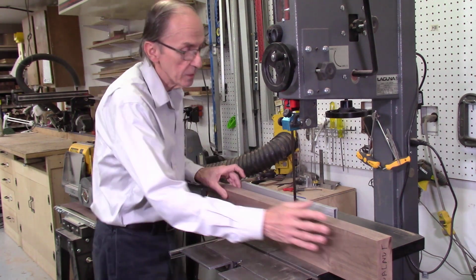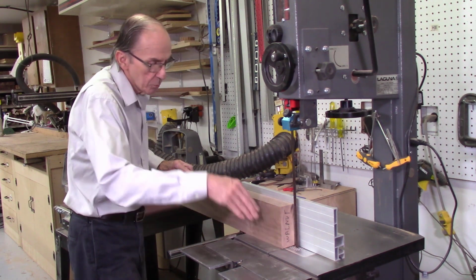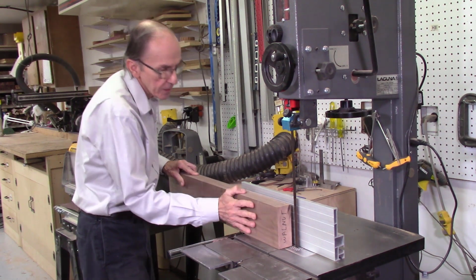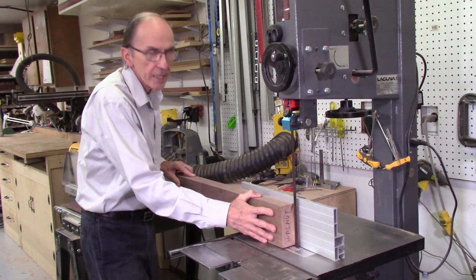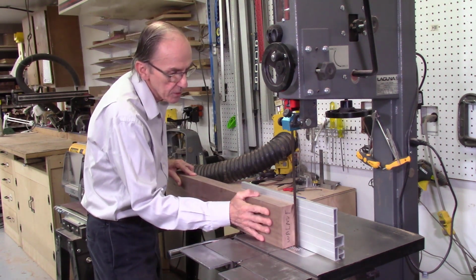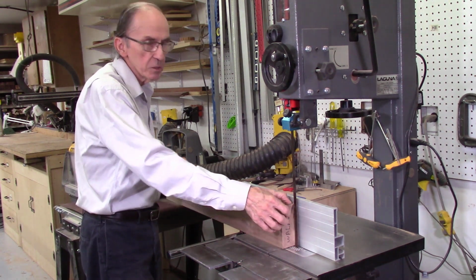First of all, when you're cutting a board using a fence, you're pushing that board against the fence, you're pushing the board down against the table, at the same time you're pushing the board through the blade. As a result, any change in movement, either hand pressure change, body position changing, the wood moving, any of those issues will cause blade drift.